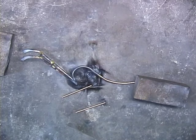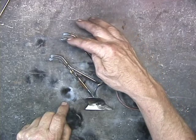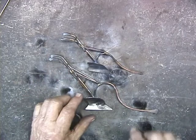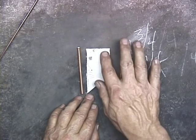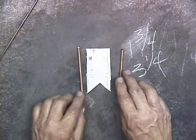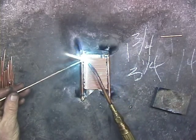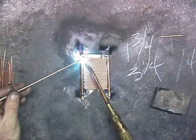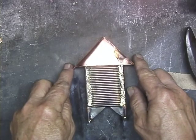Now to add the braces or supports. As you can see here, I have two plows — what happened was the first plow, the top one, was too small for the proportions of the barn, so I did another larger plow. This is a louvered cupola, which would have been found on more stately barns of that period. For the cupola, 20-gauge sheet metal is used for the sides with RG45, making sure that the V-shape of the bottom fits the peak of the roof. Using 3/32 RG45 for the louvers, brazing those to the RG45 on the side, then brazing on the copper cap.